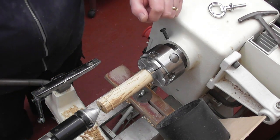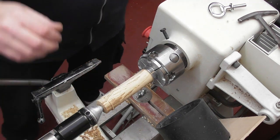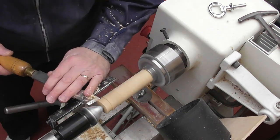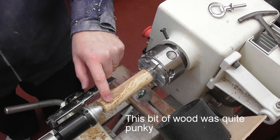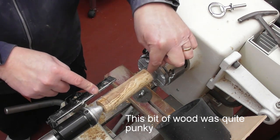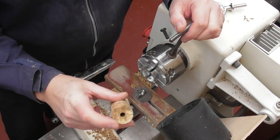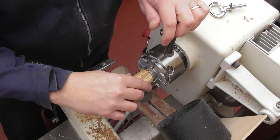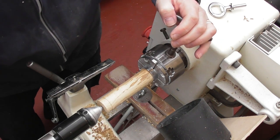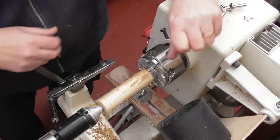Just to double check that we're still central, I've brought up the live tailstock again. I'm going to pop that in that end and lock it off and just very slightly trim this dovetail at this end. There's a little bit of movement on that end — hopefully now we've done that it's central. Now we're going to turn this around and use the center point at the other end to make sure the handle is nice and level when it comes to putting it together. This is our drilled end — it's now going to go into the chuck this way. I'm not tightening it fully; I'll bring up the tailstock, lock it off, and use the center point to make sure it's nicely centered before I tighten it off.